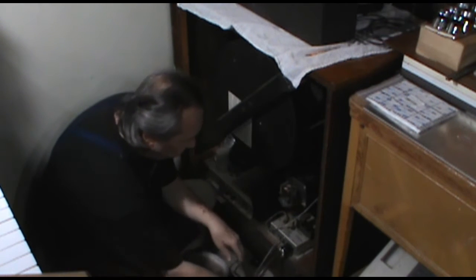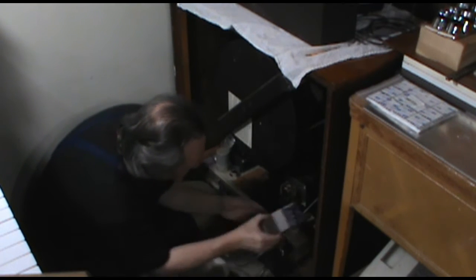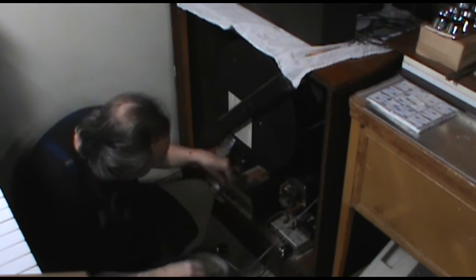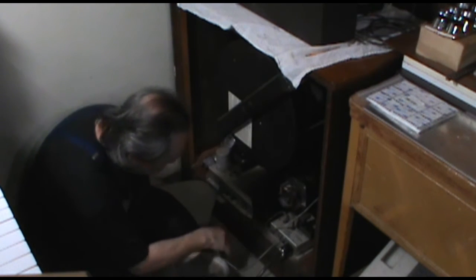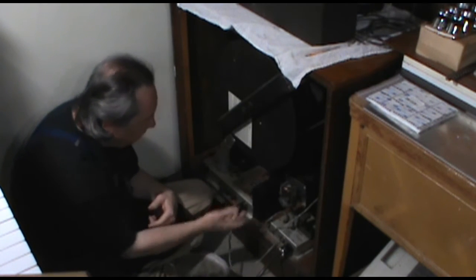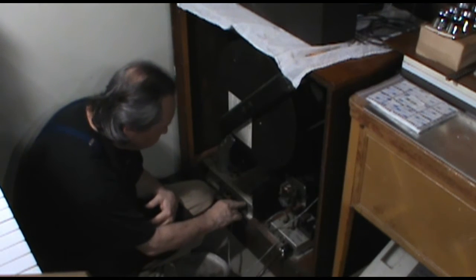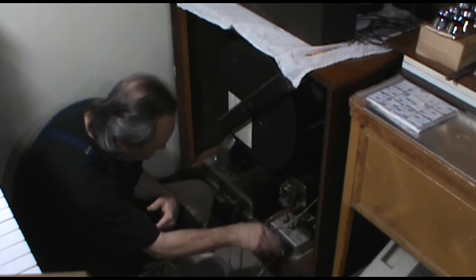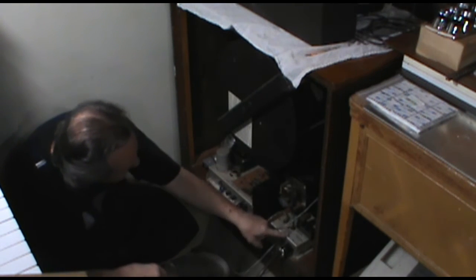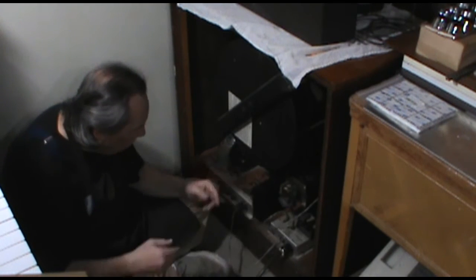So now our adapter for our little reverb unit, we're just gonna stuff the reverb unit back in here any kind of way we can. So I do want this to be fairly neat and tidy. So normally this would just go right into the amp, and then the 110 comes in, the relay signal goes out, turns the amp on, the audio signal is also going through here, then the speaker output goes back into the relay box and then out through here to connect to there.